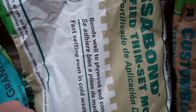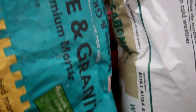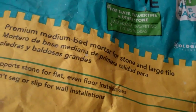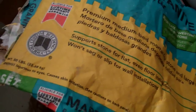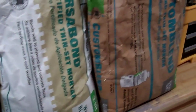If you're going over plywood or concrete, get the fortified thinset — it has extra glue so it bonds better. The premium stuff is fortified premium mortar for marble and granite. It has a plasticizer in it, which runs about fifteen to sixteen dollars a bag. The plasticizer makes it easier to set uneven pieces of stone because it stays workable a bit longer.